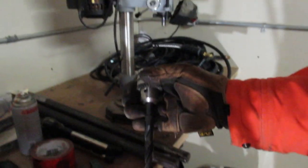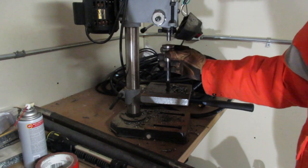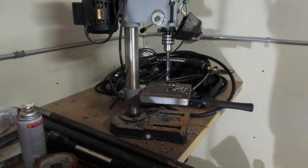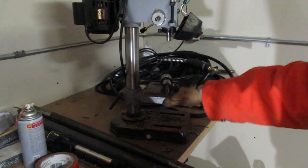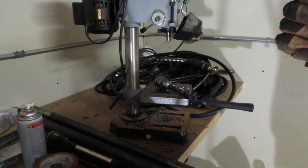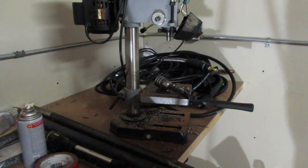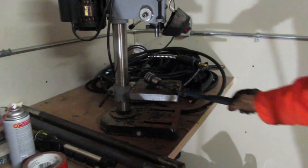Alright, so one thing I forgot about this drill press that I truly hate is that the chuck falls off the taper fairly often. And there's a bit of run out in that chuck, so it's not great, but anyway, the job is done. So when you're looking at buying a drill press, the taper is good. You can change it to different things, like you can get a threading device to put on a tap, and then it doesn't over torque the tap, and then you can automatically reverse when you pull out. So there's some pretty cool attachments you can use if your drill press is big enough, tall enough, and has the power for it. But now I've got that done.